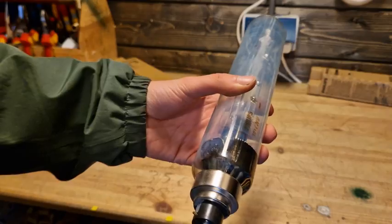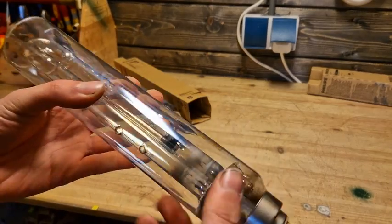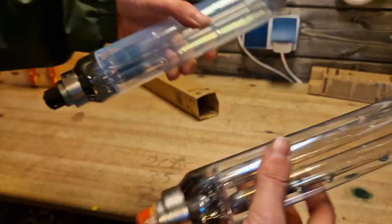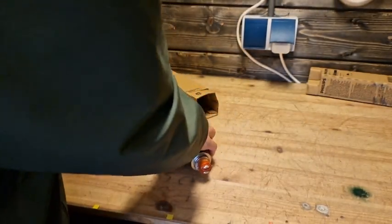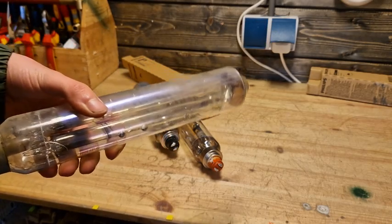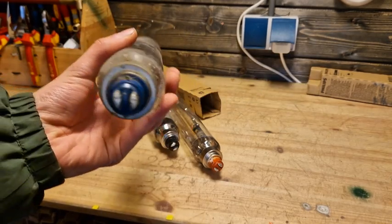There's also a 35 watt version of the same size as the 26 watt SOX-E. It looks exactly the same apart from the base, which is red — red indicating the standard low pressure sodium version. They have the same lumen output. There's also a PSG version of the 35 watt, which is a more expensive bulb designed to last longer, and it has a blue base.